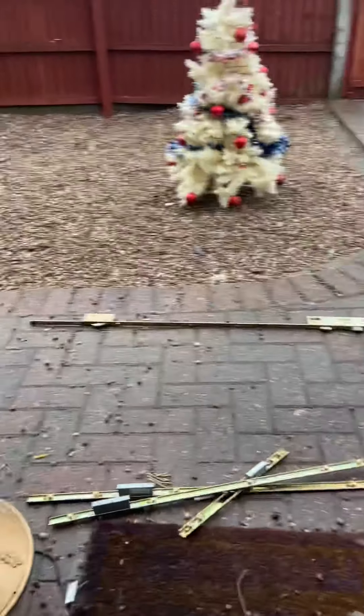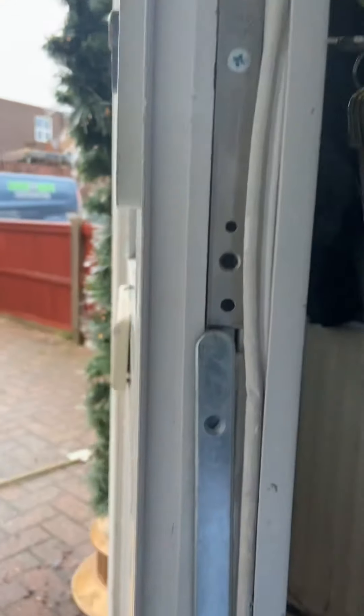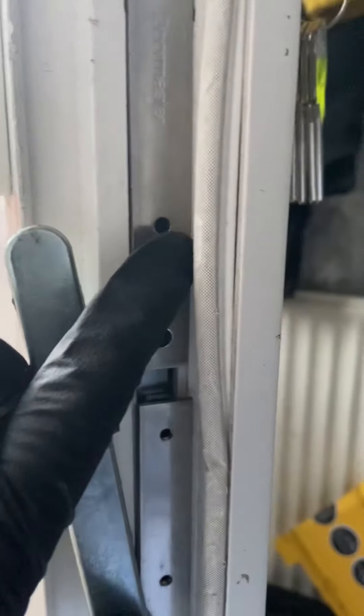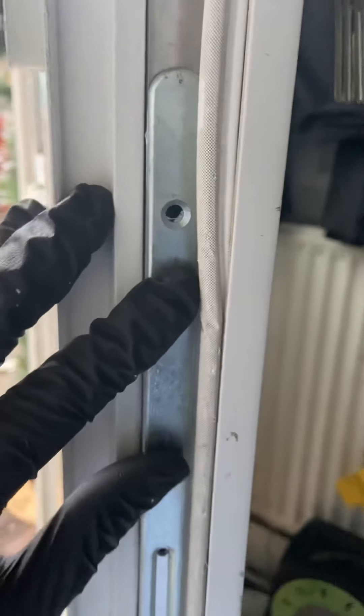With the bottom and top pieces of the mechanism — I've already put it on because it's difficult to do with one hand. The teeth on these pieces connect to the teeth on the center part of the mechanism. Then this part here — you can see a little pin there that slots into the pin on the center case like so. You then put a screw through there to hold it in place.